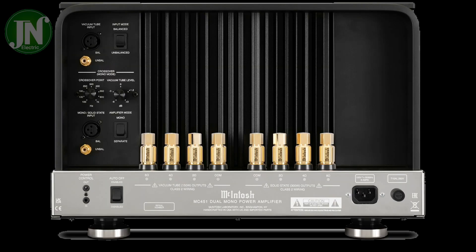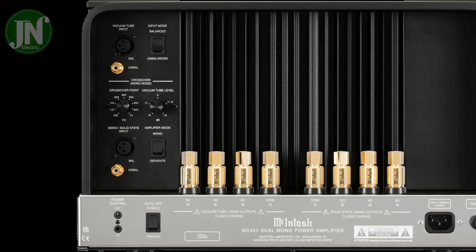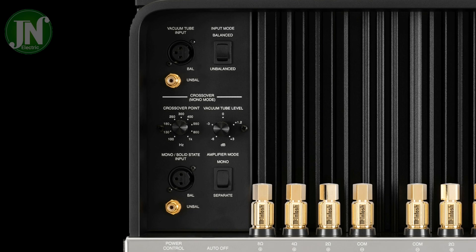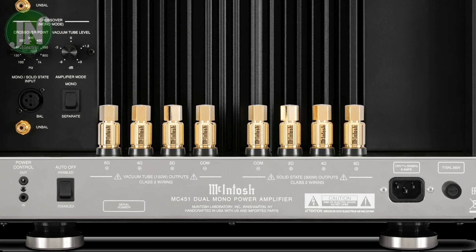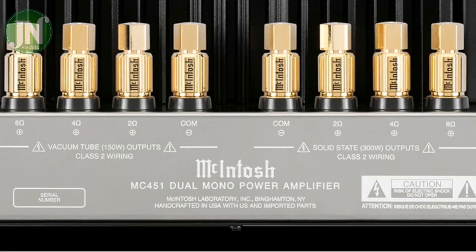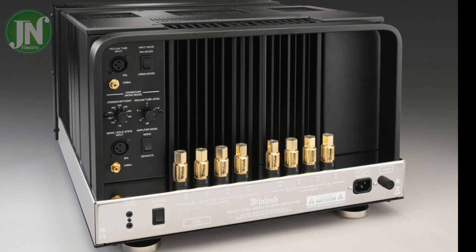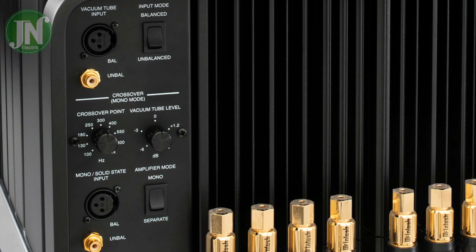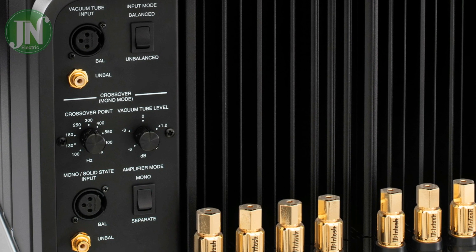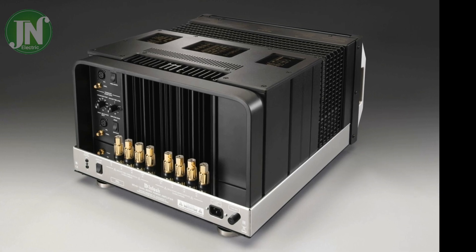On the rear of the panel, there are eight terminals, divided into four sections. In those four sections, you can have an impedance according to your speaker. You should not be wrong in matching your speaker impedance with this amplifier. Get used to seeing the nameplate specification of your speaker. Incorrect impedance will cause serious damage to your speaker or to this amplifier.